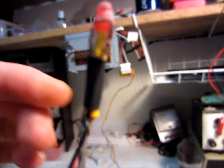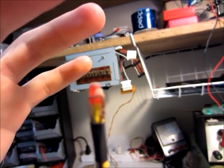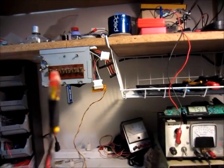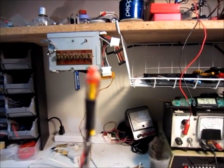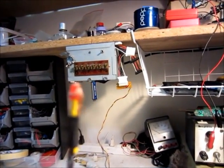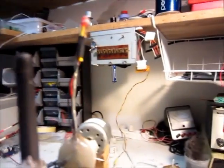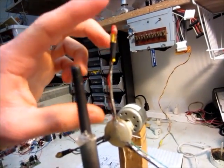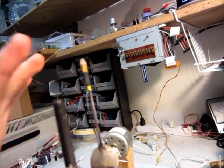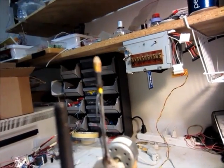All of the centrifugal force of the LED trying to go out when it's spinning really fast is getting supported by these little wires and the LED casing, not the legs. Because if it was getting supported by the legs, the legs would get pulled right out. My first design was like that, and the legs did get pulled out of the LEDs, and I destroyed quite a few. My LED lightball is quite large actually - it's about three inches radius, so the diameter is about six inches - and there's a lot of force getting pulled on this LED.